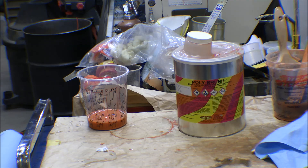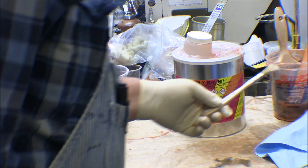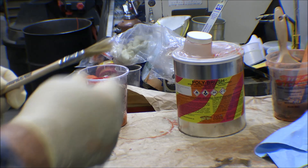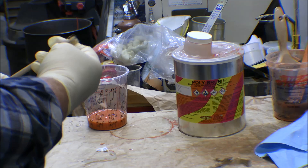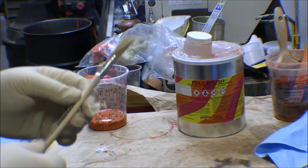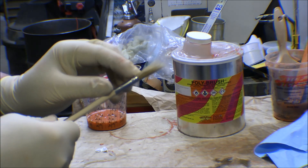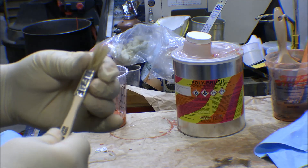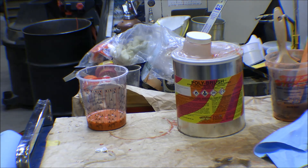What I've done here right now is mixed up a little bit of poly brush three to one. I got a new brush — my little half-inch brush disappeared and didn't do too good anyway; it got all messed up from being in the poly brush and poly tack. I got out a new brush and just filled the bottom of it with super glue so the threads don't come out — that seemed to work pretty good before. Now I'm going to take that poly brush and fill the weave on this reinforcing tape that we put on all the ribs.